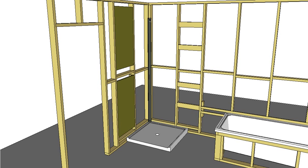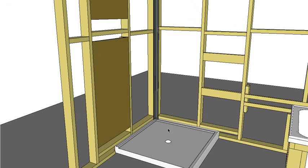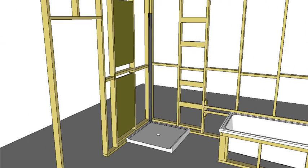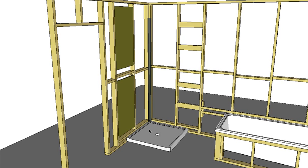The other thing with the shower, again similar to the bath — at this stage you could put in a flashing which would actually run into the shower base, so it runs inside that lip. Any water that gets in between your sheets runs down there and out into the shower base. Commonly nowadays the waterproofers do that — so you don't need it as long as, when they've got the lining on and they start waterproofing, they seal that area off as well.